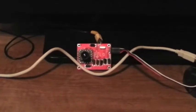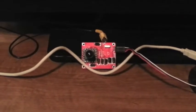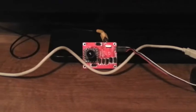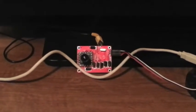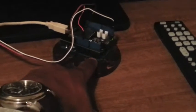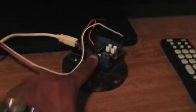It takes JPEG images 640 pixels wide by 480 pixels high, and they're in color. There's firmware embedded on the DSP chip in the back. I can query and retrieve images from buffers on the camera board using an Arduino Uno, and then the images are written to an SD card via an SD shield manufactured by Seeed Studios.